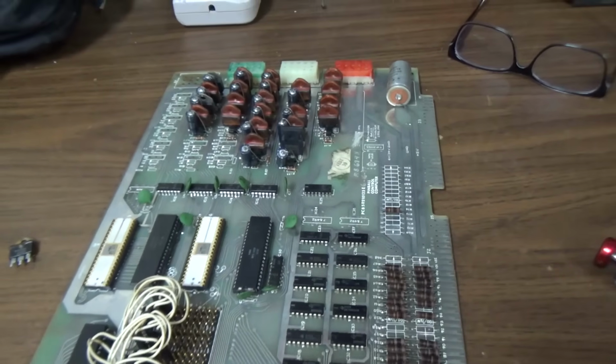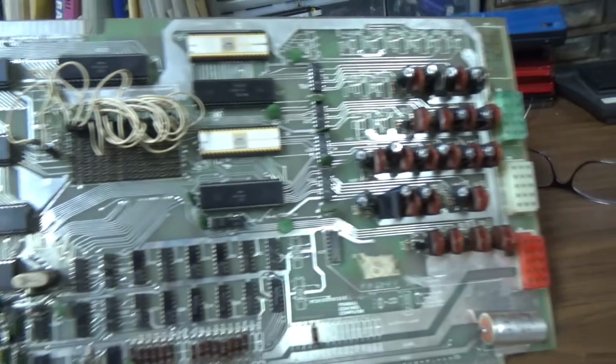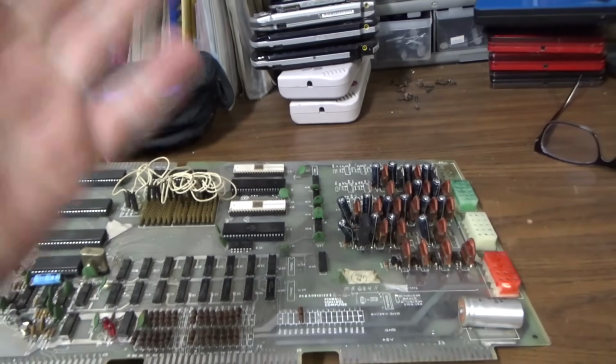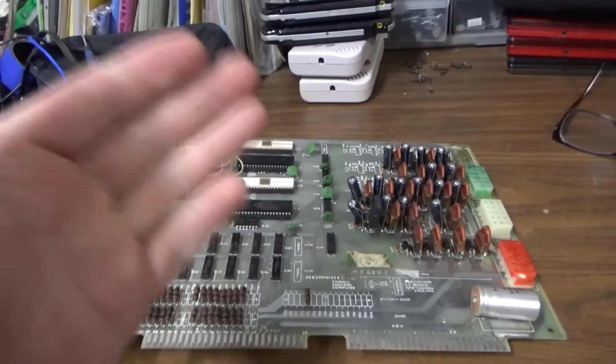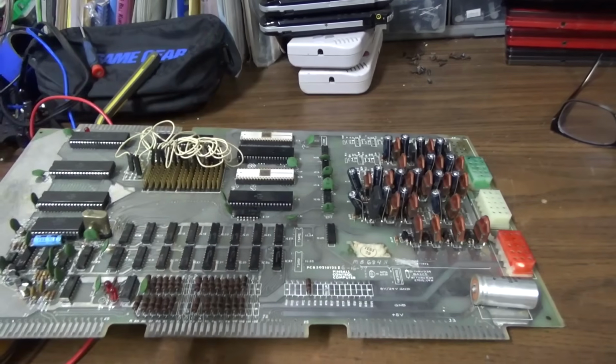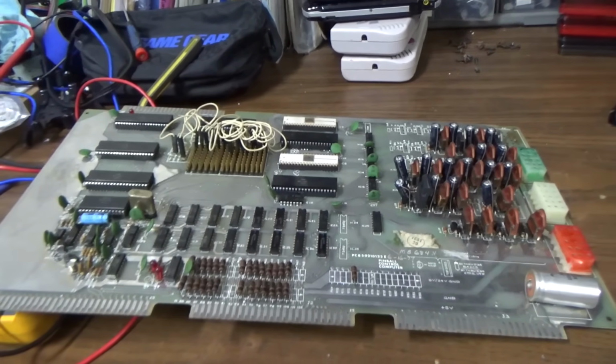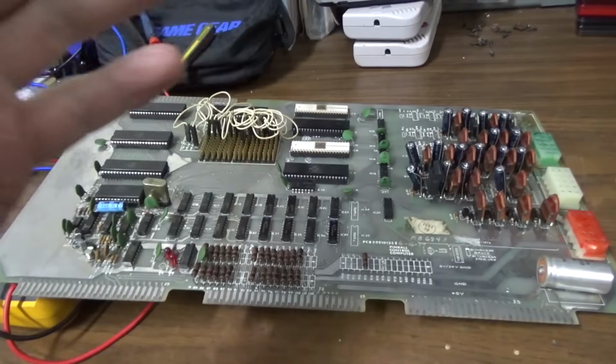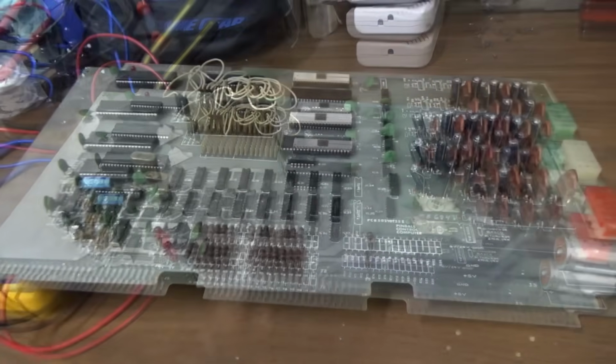But that'll be the only thing we do to it this time. And then we'll decide what kind of updates we want to do to it. I still have to, like I said, replace all of the lamps in it. I'm waiting on a drop target. I'm waiting on flipper parts. So we still got work to do. And then, of course, we have to play it. But let's slide this back in and see if that fixed our coil locking on. I'm going to reattach the coil.